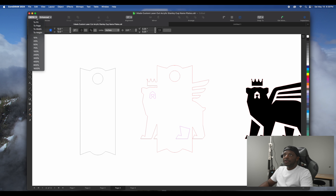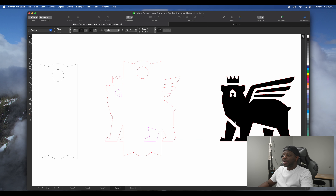Next, we have what I thought was a lion — actually it's a bear, a bear with wings or something. The Stanley logo. I used the other measured template, got the logo, put it on top, and did my magic with CorelDRAW. I'll score certain parts and possibly cut some out so light can shine through. This is going to be white acrylic with black acrylic on top — I'll cut everything out and use 3M tape to attach it. Again, three layers.